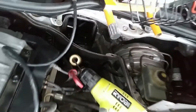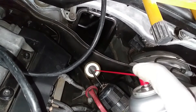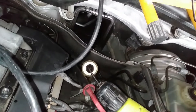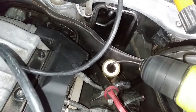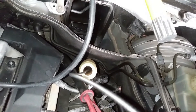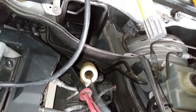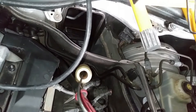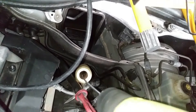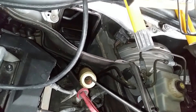Stop periodically and spray a generous amount of cleaner in there. Once we're done with the cleaning, we're going to use compressed air blown into the hole to try to push as much of that cleaner out — along with whatever dirt was cleaned out by this process. Make sure you've removed all the plugs before you blow through with compressed air.